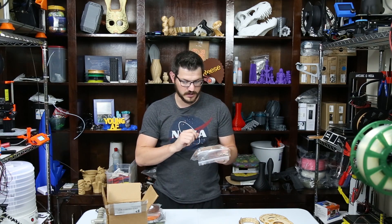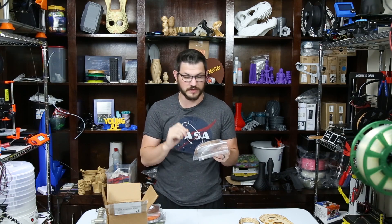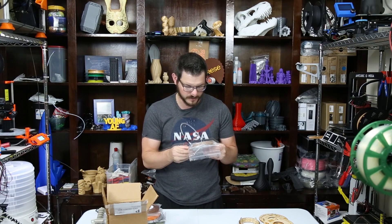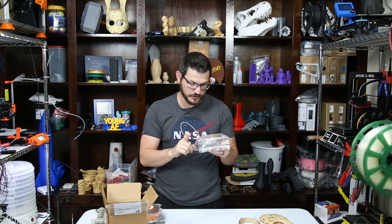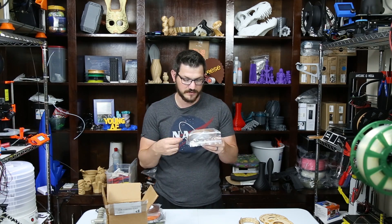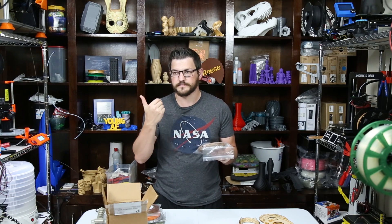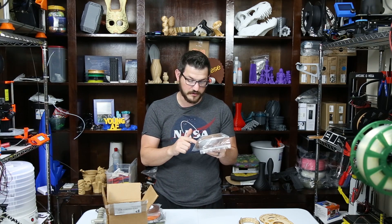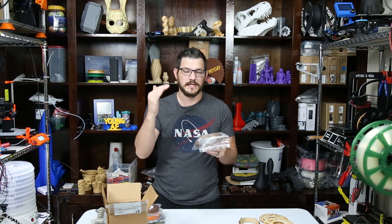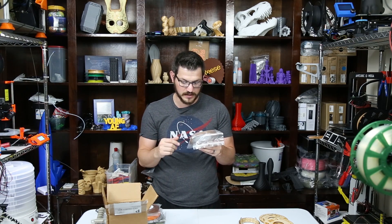First up, we have 3D Best Q's wood-filled PLA — never heard of this company before, but I'm super excited. It's a premium wood fill at 30% wood, meaning 70% plastic. A true wood-tone filament — it can be sanded and stained, and it's less abrasive than other composite filaments. Print specs: 30–100mm/s print speed, extruder temp 200–220°C (may need to bring that down, as wood PLA normally prints lower), bed temp 0–50°C, and non-abrasive.